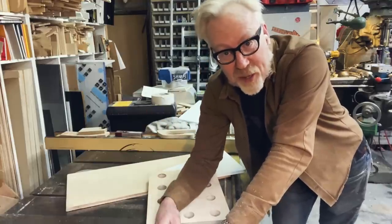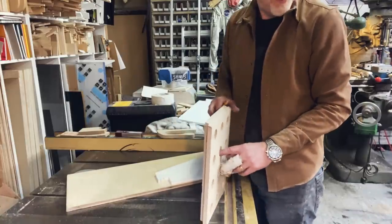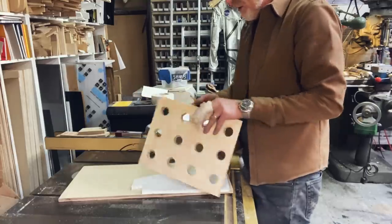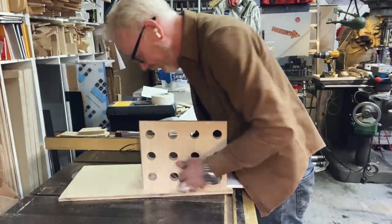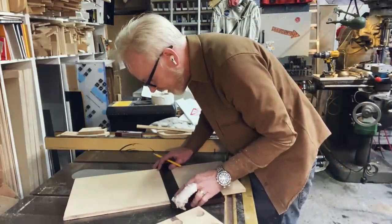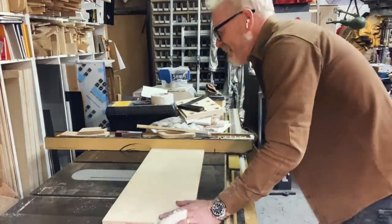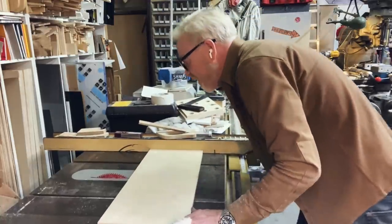These are the videos where I cut my head off — that's what happens when I'm shooting my own videos. I've actually cut this at an angle on both sides; didn't even log what angle it was, I just used my angle finder. Now it's time to cut the wood from this cardboard template. I've also trimmed the height down to be more efficient. I need these two pieces to be exactly the same size, so I'm making a measurement now — I might actually be able to template these two things together.